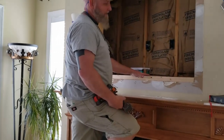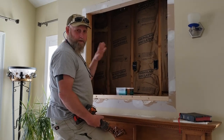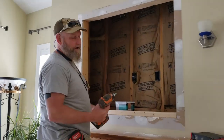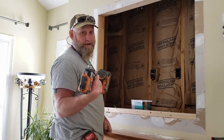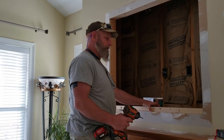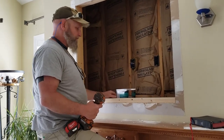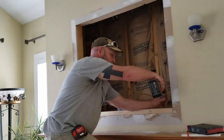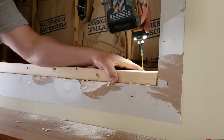So our bottom plate - I don't have to put this in here but I'm doing it because it's just going to give it more strength. They might want to hang one of those 100-inch TVs up here going past the walls. Anyway - green tip star, we call it a GRK tip because these usually come with our GRK screws. We use GRK screws a lot, GRK lags too. In my opinion they're far superior to just using galvanized lags - they're way stronger.